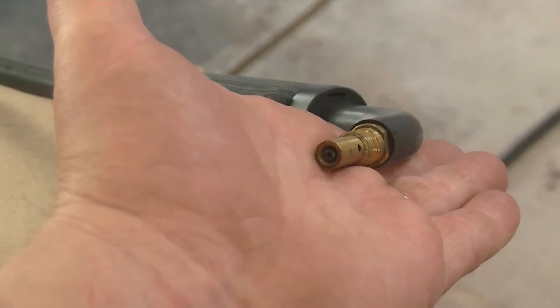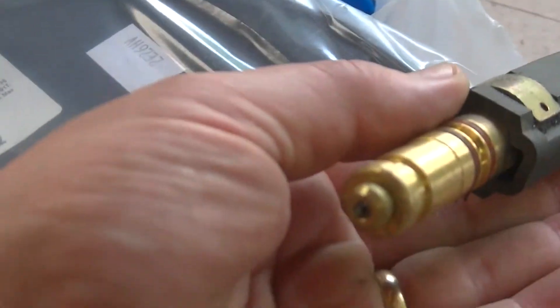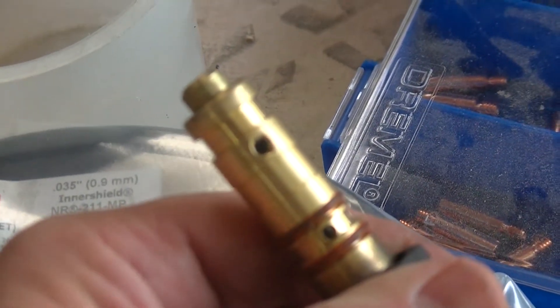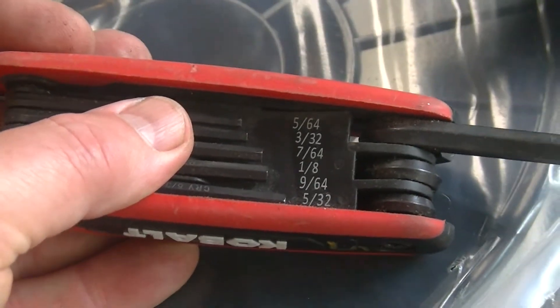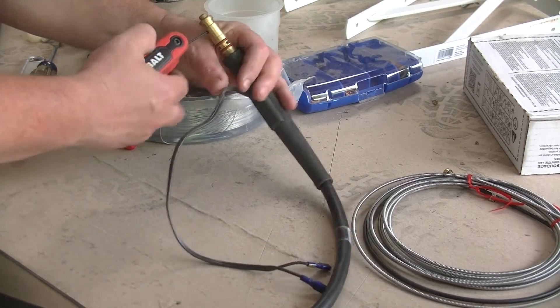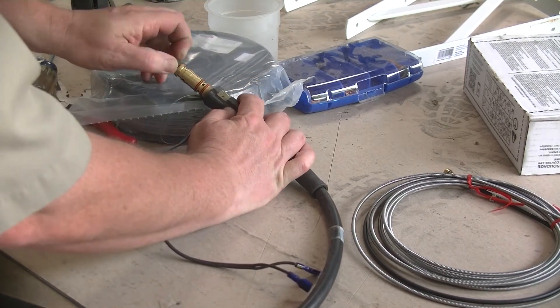Now you're going to have to remove the old liner. If you look in the nozzle — the gas diffuser end of your gun — that little coil in the middle is your liner. It's just like a big coiled spring, so we're going to gently pull that out of there. On the end of the gun you've pulled out, inspect the two O-rings for any cracks or dry rot — it's a good time to replace them if needed. My manual says there's a slotted retention screw, but mine is actually a little Allen screw that holds the liner in. Back that off and you can pull out that little brass button — that's actually the end of your liner. Be nice and gentle when you pull this out.